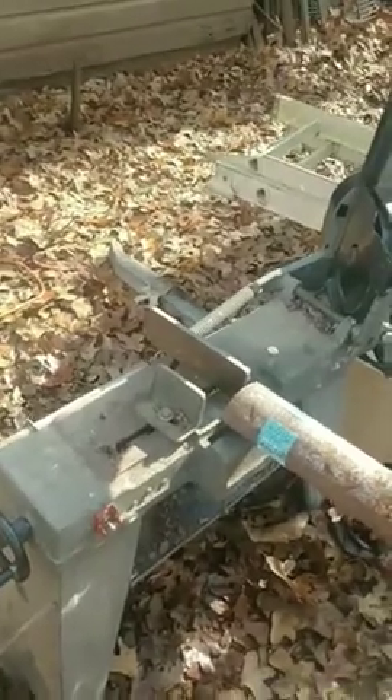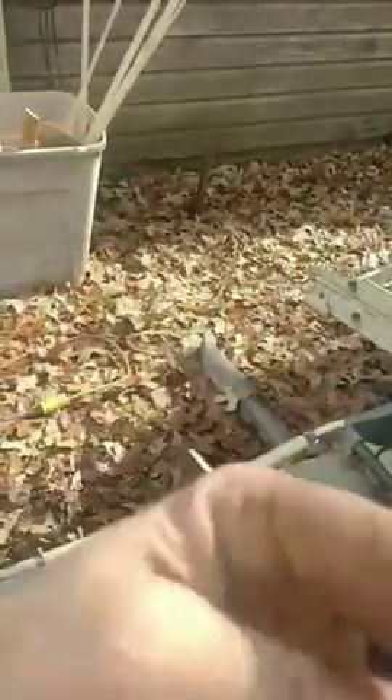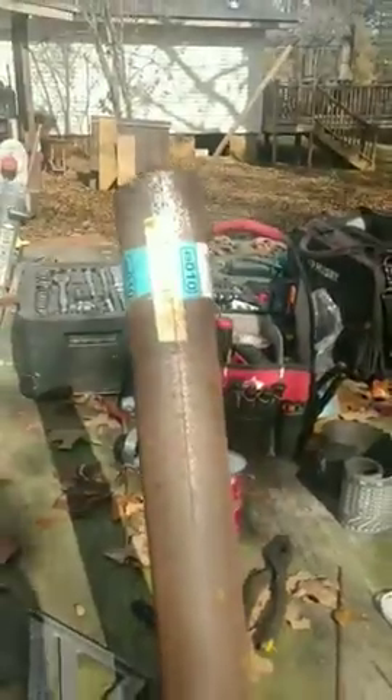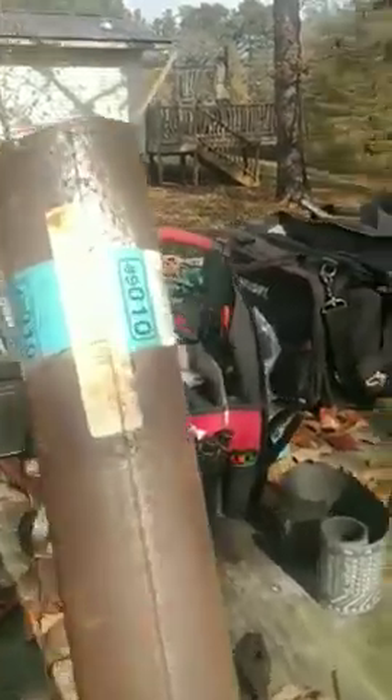How cool is that? And then you can make complex bends, rotations — you can make it go up, over, around, beyond, between, through, beside. First thing you want to do in order to make pie cuts is take and make two marks 180 degrees from each other.